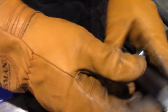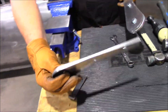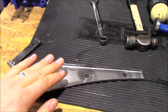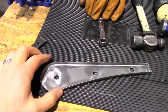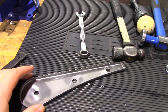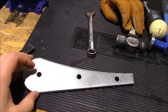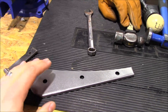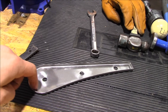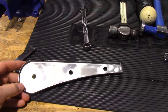As you can see, we've got some marred-up places that'll be taken care of with a file and a sander as part of the metal finishing. When we get done with it, it'll be a smooth piece like that part. So let's look over this piece real quick. You've seen the thick pieces of metal cut out on the plasma table, and he was able to form this sheet metal over with the hammer. This is really impressive, especially in areas with a lot of curvature where a press or a regular sheet metal brake just does straight lines. You can see he's got outside curve and inside curving here — very handy.